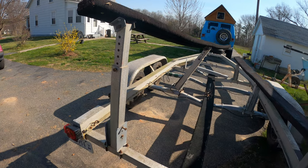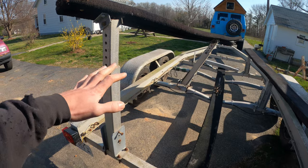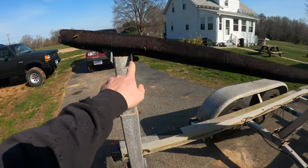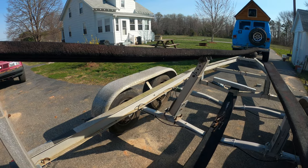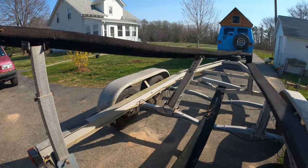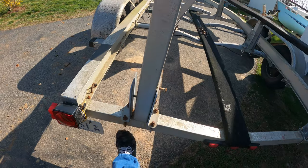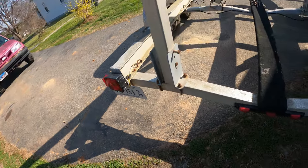So last time I saw this thing, I was talking about this bunk. Well, I loosened all the bolts except for this one and the one up there and right there. They need to be cut. They're extremely rusted and the impact won't even budge them. I had to wait because I was cutting the U-bolts all off, and this last one broke my cutter disc. It grabbed and it just exploded, so I had to get some more.